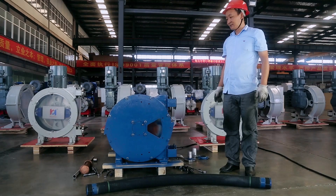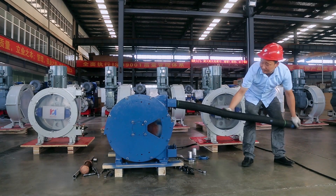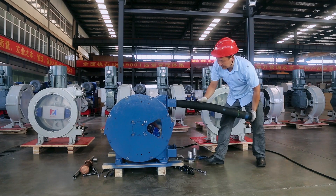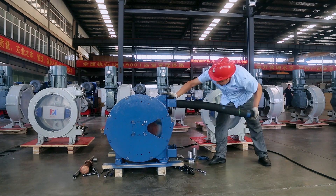Next, demonstrate the new tube installation. Feed the hose from the top into the pump cavity. Inch the pump, aim at the roller gap, and push the hose into the pump cavity. With the rotation of the rotor, the hose will be gradually brought into the pump cavity.